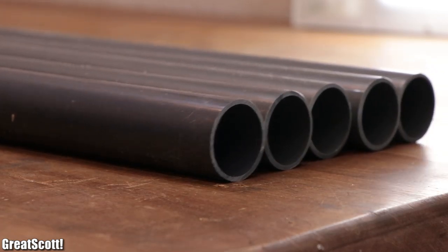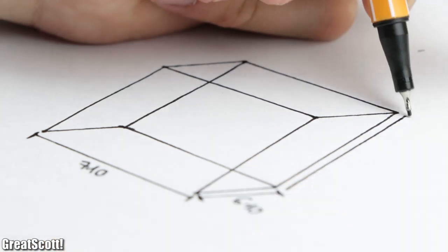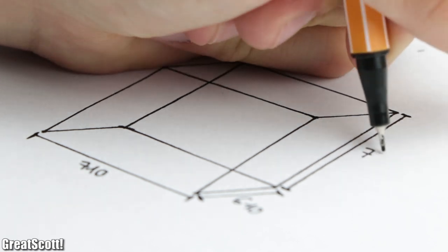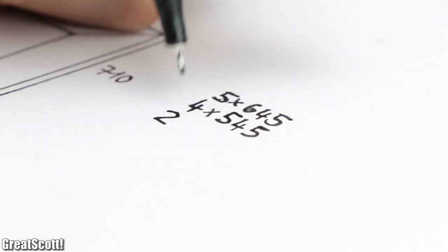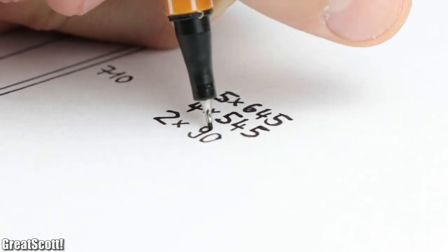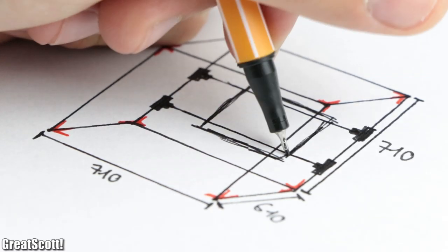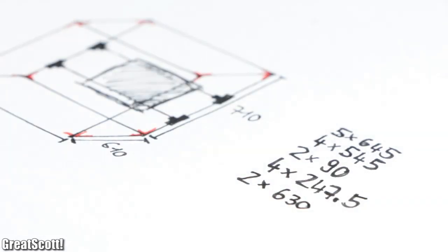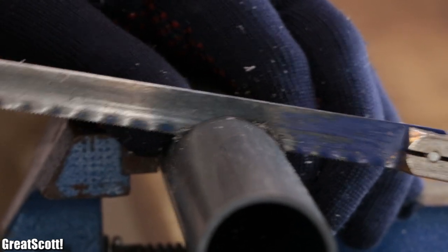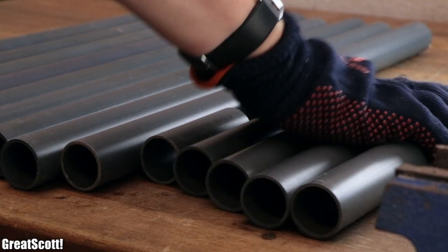Which means it was time for me to head into my garage and perform the mechanical work. Before that, I drew a blueprint with measurements for each PVC pipe, so that the rig will ultimately feature dimensions of 71 by 61 by 71 centimeters, which might sound small but is certainly enough for my intended shots. Since I also got T pieces to secure extra bars to mount a monitor, it took a bit more effort to calculate all the lengths. But as soon as I got all of them, I marked them onto my PVC pipes and started cutting them with a simple handsaw. After also sanding the ends of the pipes, I basically got all the components for the main structure of the rig.